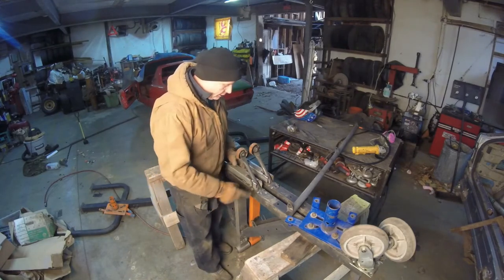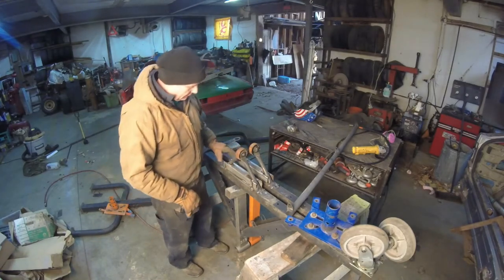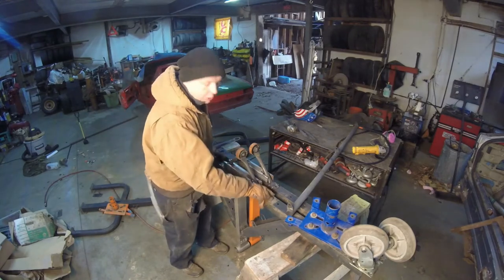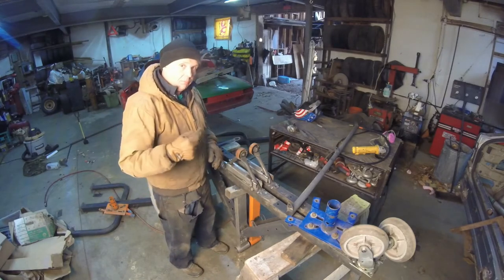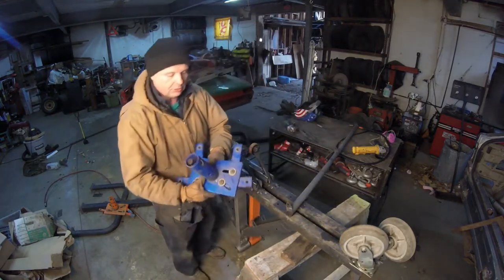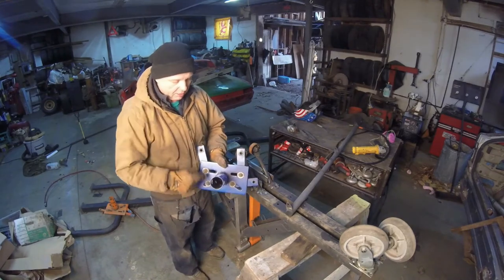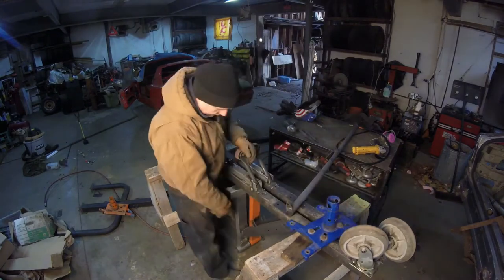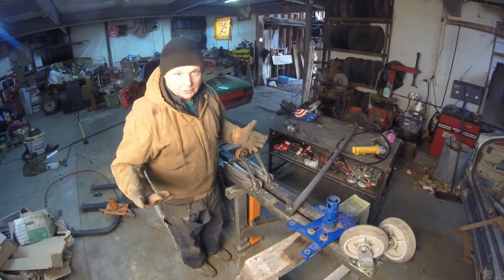Now what we gotta do is, this is our safety wheels. Second, it actually creates a little bit more of a triangulation cross brace to keep this tube stable so it doesn't collapse. Third, on the rotisserie, it's just like an engine stand. This is what the engines are attached to. This is the yoke, that's what I would call it, and the engine bolts to this. And this weld right here is designed to take 750 pounds, which is great. And along with that collar down there, the receiving collar, and that's two of them, so that's 1,500 pounds.